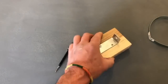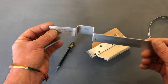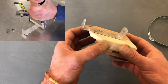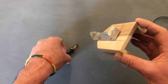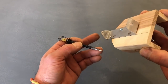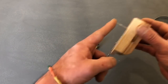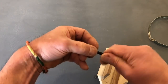You take a piece of aluminum — this is one-sixteenth thick, one-inch wide aluminum bar stock, available at Lowe's or Home Depot. You bend it — you can do that in a vise or with a hand brake used for roofing and siding bending. Drill a couple of holes — a hole down here for the pen tip. You want to measure the metal part of your pen tip pretty accurately and drill the appropriate size hole just slightly bigger so that it will freely slide up in there without too much slop. Clean off any burrs.